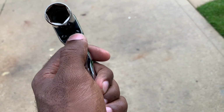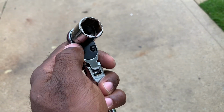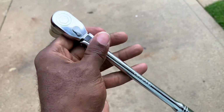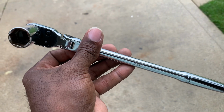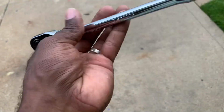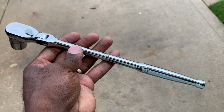You need to incorporate Loctite. We're going to put some Loctite on these two screws in the back just to make sure things are held together nicely. And as far as the O-ring, because you do call it a sealed head design, that may require a little bit of a revision. I don't know how you guys are going to incorporate that, but I would like to see some type of an O-ring or a gasket to ensure that if the ratchet falls in oil or brake fluid or some other media, it does not affect the fit and performance of the tool itself. So check it out, guys.